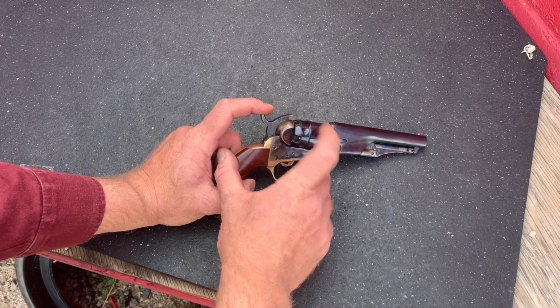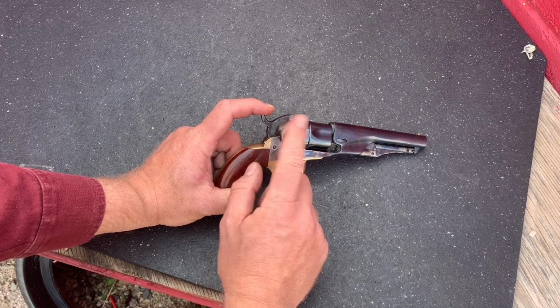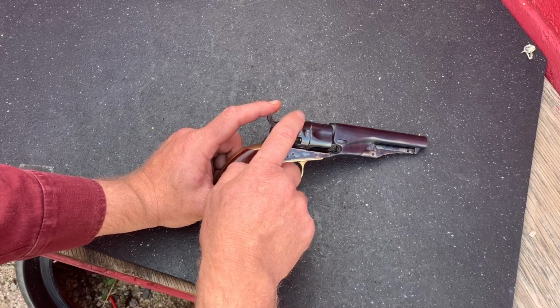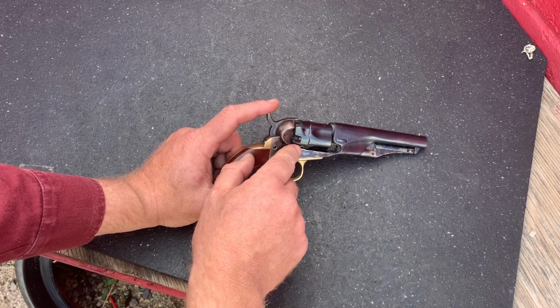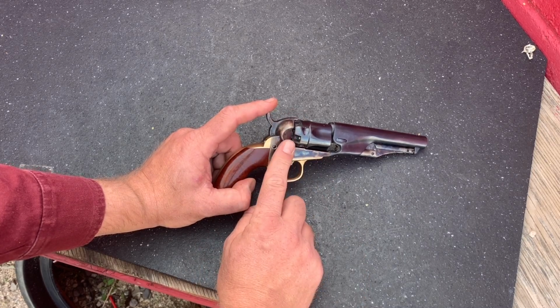And when the hammer bounces, that's what allows the cap, or fragments of the cap, to fall into the action. If the gun fires and the gas does not cause the hammer to bounce, that keeps the cap on the firing cone, and when you cycle the action to get to the next chamber, that cap just stays or falls off out the side, and that prevents cap jams.